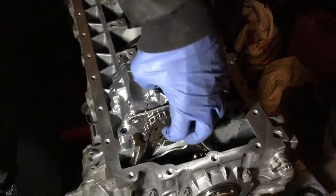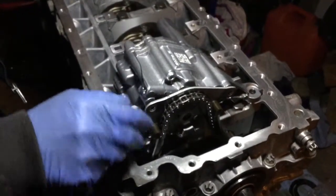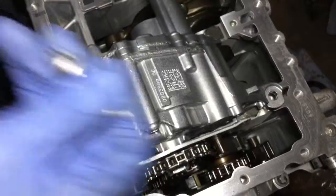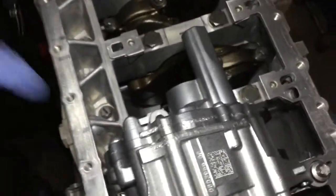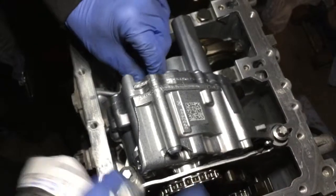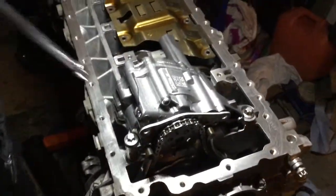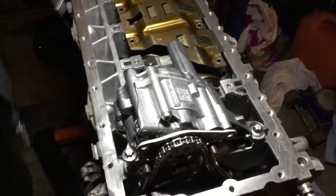So now the pump is properly seated. I'm just going to put the bolt on. They're very long bolts, go up front here. Yeah, looks like it. The third one is on that side here, goes right here. We're gonna torque this flat, and then we're going to put the sprocket on the shaft. So I'm gonna look for the torque. I'll get back to you with what I found, but again, look on your end. We gotta set it up to 88 pound-inch, 88 pound-inch for the first level of torque for the three bolts.